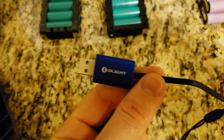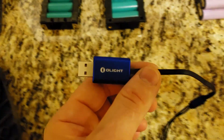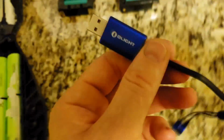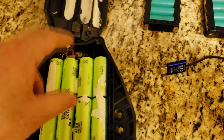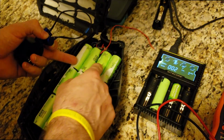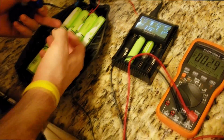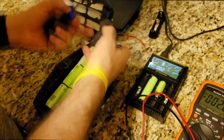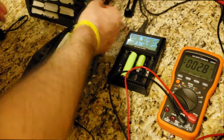It's not designed for lithium phosphate, but as long as you reach 3 volts or 3.3, make sure you don't go above 3.3, because that's going to hurt the cell, and overcharging will swell the battery and can cause explosion and fire. So make sure you don't pass 3.3 volts. What you have to do is monitor with the voltmeter. If all cells are 3.20, you have to make sure the cell with the issue, let's say this is the one, you charge to 3.20 volts. If they are all 2.9 volts, then the cell with the issue has to be charged to 2.9. Once you bring it to that voltage, then your pack is all fixed and you can ride.